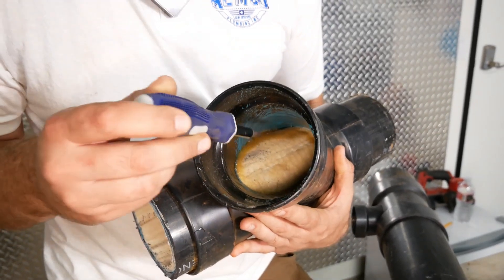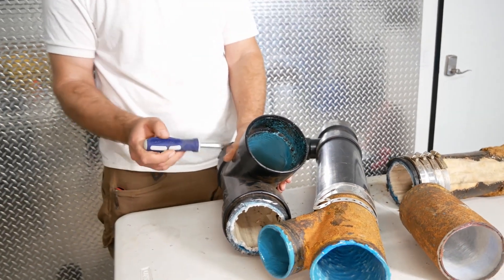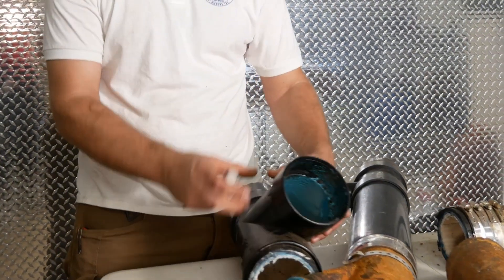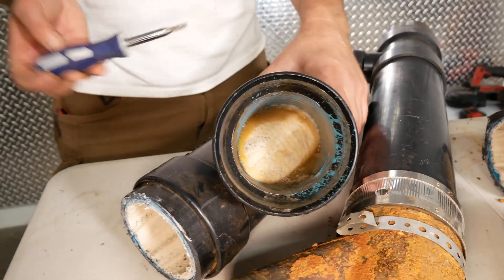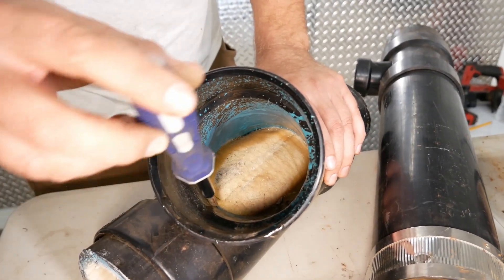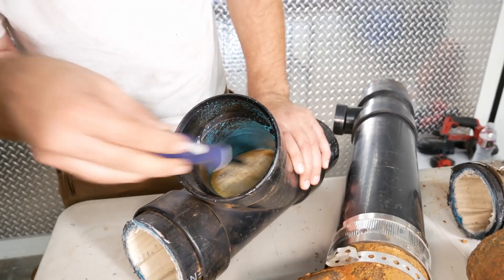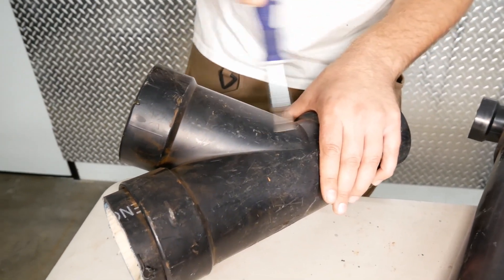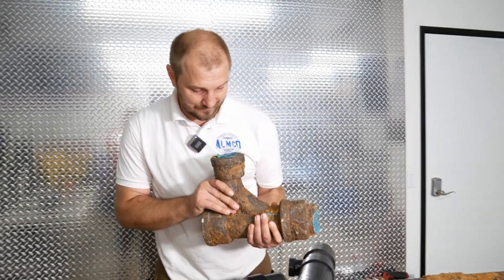The city has a main line and they drill a hole for each branch, which is your responsibility, not the city's — that's where the saddle is on the city line. Most of the root intrusion comes right at that connection, blocking your drain, and the city won't repair it because it's your responsibility. If you drill the hole, the epoxy is not attached to the pipe at that point, water gets between the two layers, and roots grow in. Your liner stops in a circle at that hole — everything beyond is a free spot, meaning unlined pipe.